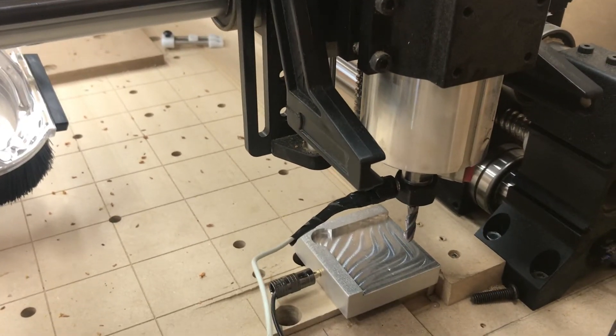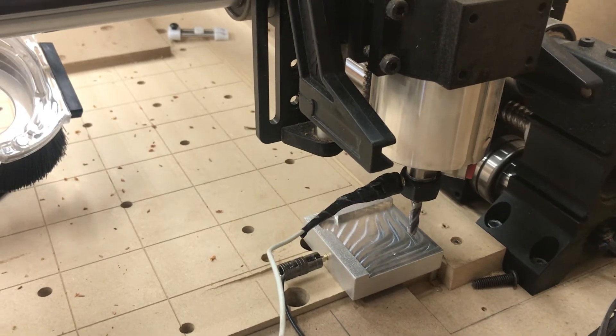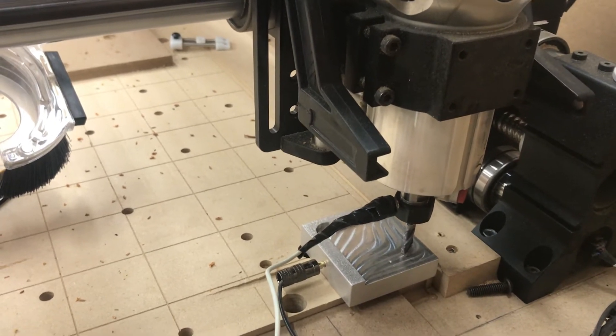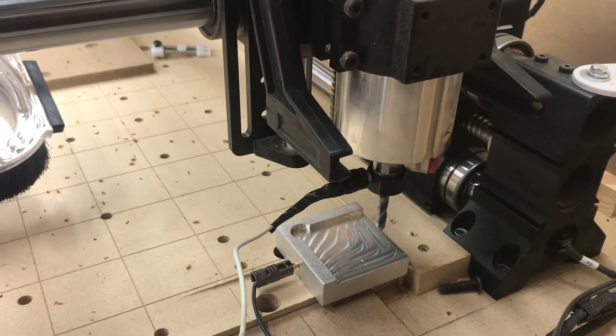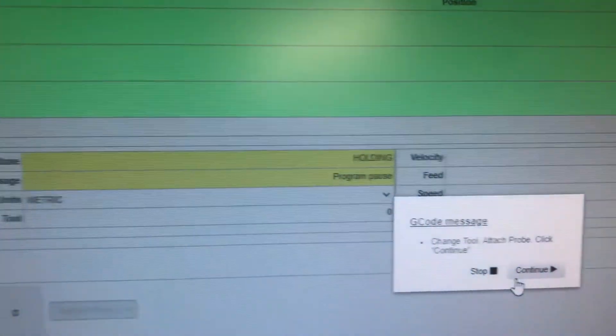So it's going to seep down and find that probe again. It's a little bit slow, but it's suggested that this is kind of the maximum feed rate you should go when probing. The height I've set this at is to allow for a 2-inch stick-out to be changed without being a problem getting the bit out. So it's done its first probe.